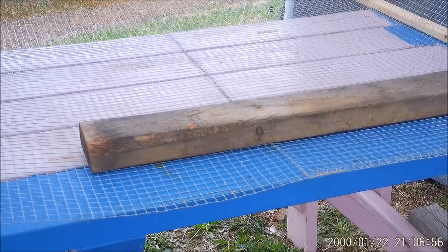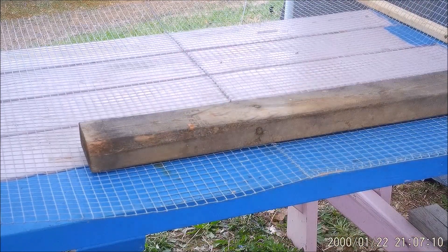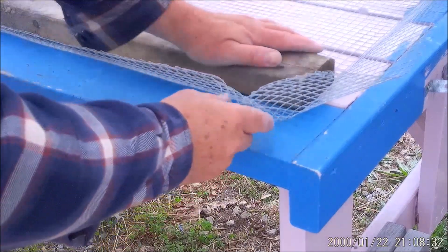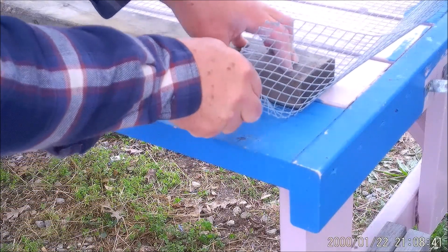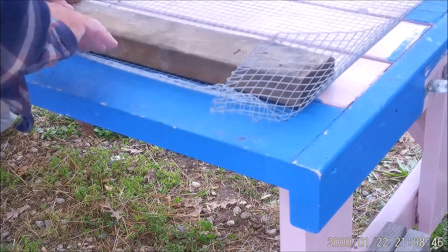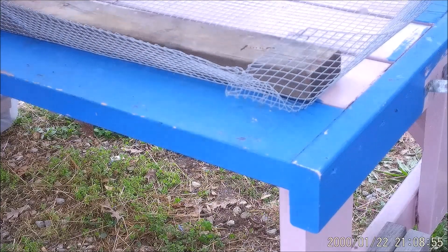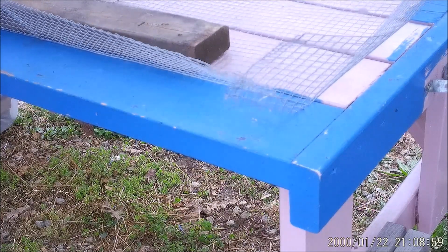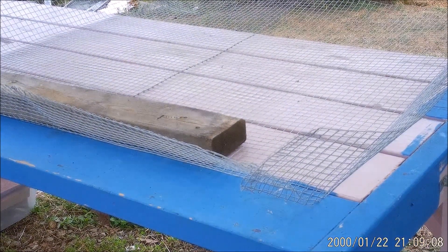This one we're going to do about five inches in from the side — top and bottom. So five inches here, five inches here. Just fold it up, and have it sort of reflect inward. That'll help the signal get concentrated to the back of the antenna. Just fold it up, bring it in, fold it in — no big size, it's just going to help the signal. We're going to do the other corner and then we're about ready to mount it on the back of the antenna.